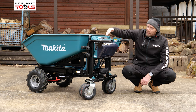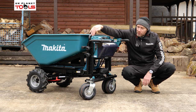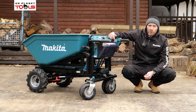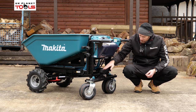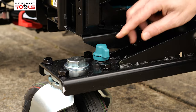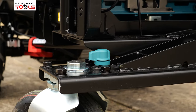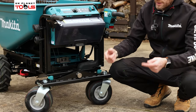The side handles are fully adjustable and easy to do without tools. There are two nuts on the side — if we just loosen them we can raise or lower the arms to our specific required height. On the back there are two blue knobs for the wobble control on the front of the machine. If you unlock them it will allow the machine to tilt as it's going over rough ground, always keeping the powered wheels on the deck so it can always deliver power.